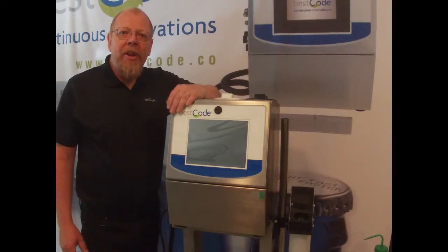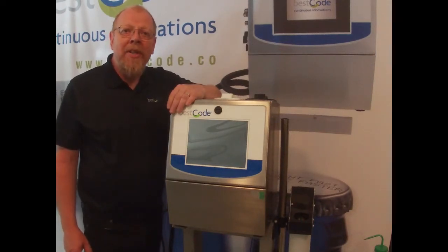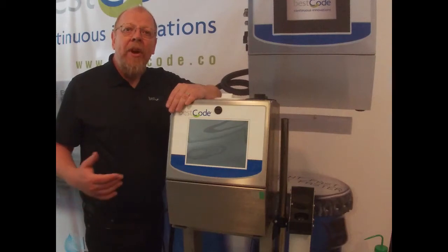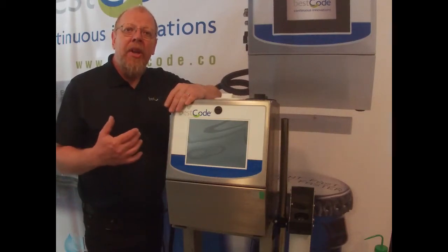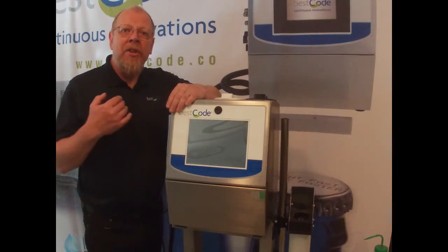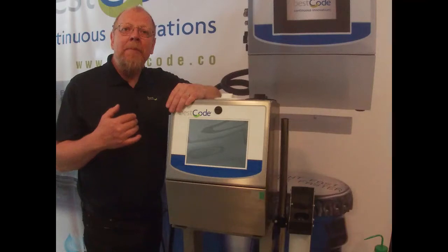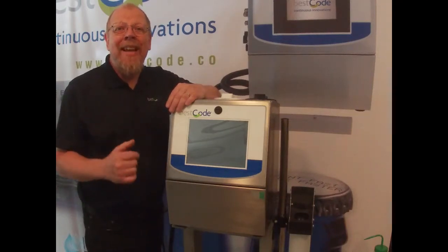So in this short video tutorial, I'm going to be talking about viscosity. Viscosity is very important on a CIJ, a continuous inkjet, because the process in which we are splitting the droplets of ink from a continuous stream is very precise. We use an oscillator, a crystal that is oscillating at 65,000 hertz. So that is basically splitting that stream into 65,000 droplets per second.